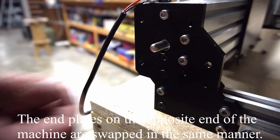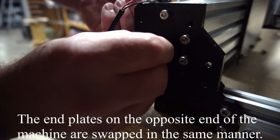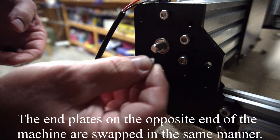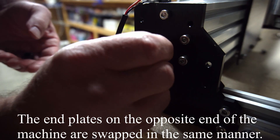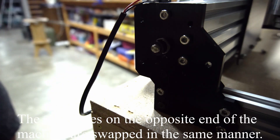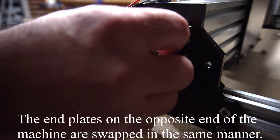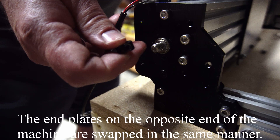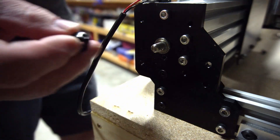You'll notice here that this end plate has the recess for the ball bearing on the outside instead of the inside, as in the original construction. And then I've put the little spacer washer here and the locking collar on the outside. Now there's a real problem with these locking collars — it's that they have that horrible little tiny grub screw in there and they always strip.